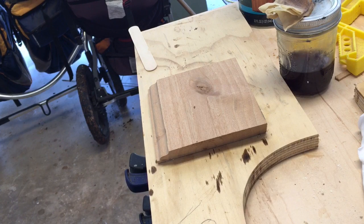We're going to do an epoxy top coat on a piece of knotty alder. This is MAS brand epoxies. It's a two-part epoxy. It's a low VOC, so it doesn't smell bad, and it's zero blushing. So unless it's 100% humidity, it's not going to condense moisture onto the surface. So you can do one layer upon the other if you want, without having to sand or anything. We're just going to do one layer.